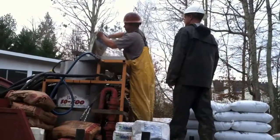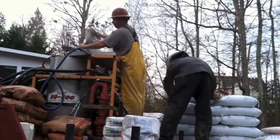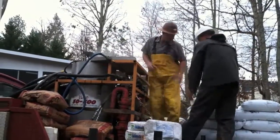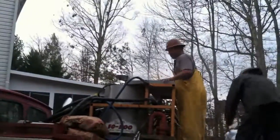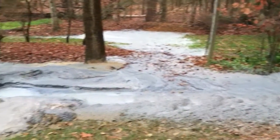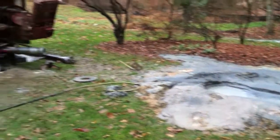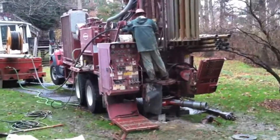After the installed loop, they backfill the hole with a mixture of bentonite grout and sand. This is the grout pump. The drilling does make a pretty big mess — this is basically ground-up granite rock and well cuttings. And here's where they're pumping grout back into the hole.